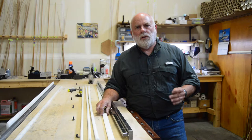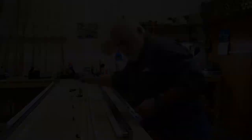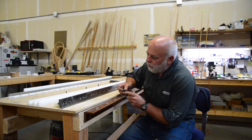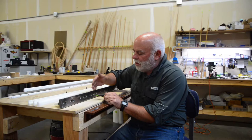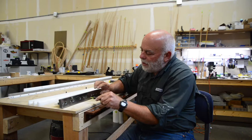We can take our screws and start screwing them in. I do not tighten them at this stage. Once I've snugged them all down, starting at the beginning I tighten them one by one. You do not want to over-tighten these, because all the pressure when cutting a strip is downward. I basically use about two fingers to tighten them and that's enough. If you over-tighten them, you could actually pull the brass inserts out of the anvil. That's the reason we don't give you T-wrenches — we don't want you to over-tighten anything.